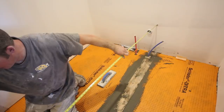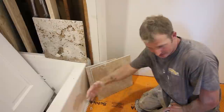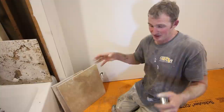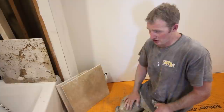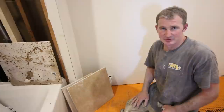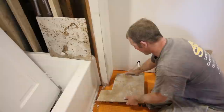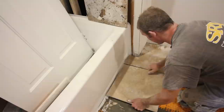We've got a six by seven foot bathroom, so it's fairly simple with an 18 inch tile. We're going to start on this wall and work from the tub back. The tub is going to be your main focal point as far as being straight, so going off the tub usually makes the most sense. You square off the tub and work your way back. With 18 inch tile, a full tile will bring us straight over into the middle of the doorway.